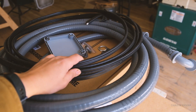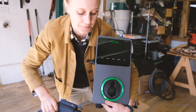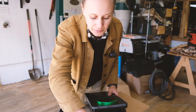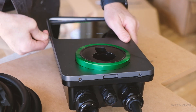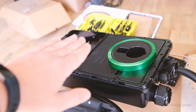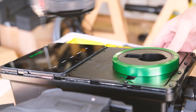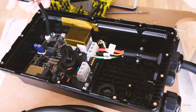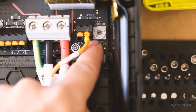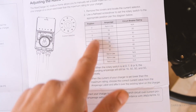This is an 8-gauge wire rated for 50 amps — it's going to go through this conduit. There really aren't that many parts to this job. We need to funnel the wire through here, drill a hole through the wall, attach the plate on the outside, and connect the wiring. You don't have to take off the whole unit — you can just take off the center part. I want to show what it looks like inside. There's the lid part and the interior part. This little dial, where you see the numbers, is where you can hard-control how many amps you want this to deliver. In the instructions you can see the positions and what they correlate to.